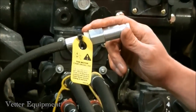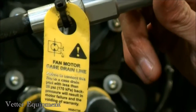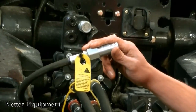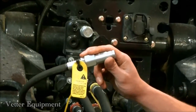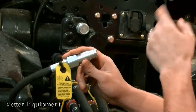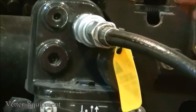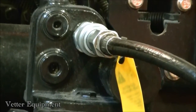Let's talk about the most important hydraulic line you can hook up — this is the case drain line. Depending on your configuration, you're going to have this line connected to your vac fan motors, or in this case we're using it for our bulk fill. This protects the motor on your bulk fill fan, so you want to make sure you get this plugged in. Just make sure you have the right coupler that plugs into that tractor. There have been instances where if you didn't feel that hard click — maybe you pushed it in and thought it was engaged — it wasn't connected properly and we had big problems and blew that motor right away.